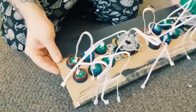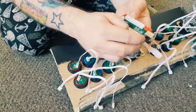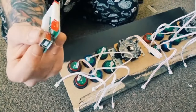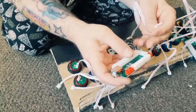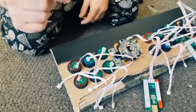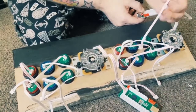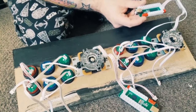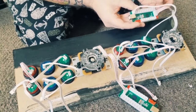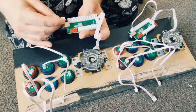And I'm going to work on both sides, because each port needs to be mapped identical to the other port, how it's laid out with the encoder. So the same serial, so say A, needs to be in the exact same place on each of these encoders. So I'm going to just put the joystick 5-pin serial into here, and we're going to pretend this is A, button A, okay? So I'm going to put button A into this, and then I'm going to do the same for player 2 on the same button, going into exactly the same port here.